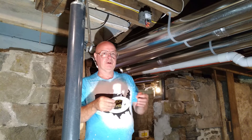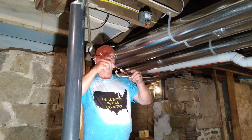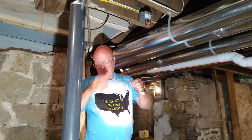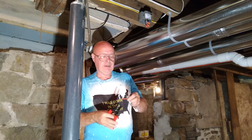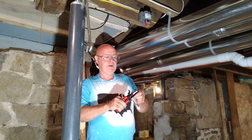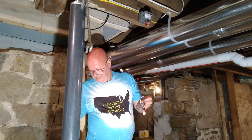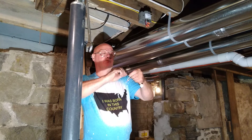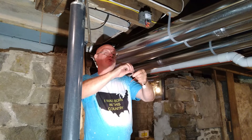I'm going to show you how to hook up an interconnected smoke detector. You have an orange wire which is a trip wire that sets off the other alarms — it has a little rubber cap on it. You take and cut that little rubber cap off and strip that wire. You have your black and your white; in the country I was born in, your black wire is live and your white is neutral.